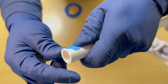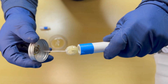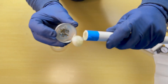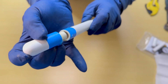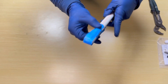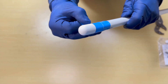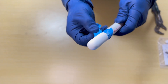The tape should be placed as close to the edge of the ceramic cup and the bottom shaft as possible. After taping the ends, apply your adhesive — in this case a pre-mixed two-part epoxy — to both the shaft and the ceramic cup. Insert them so they stick together; in this case the cup had to be secured with additional tape so it could fit flush with the shaft. After the adhesive has dried, remove the tape, being extra careful not to damage the ceramic cup.